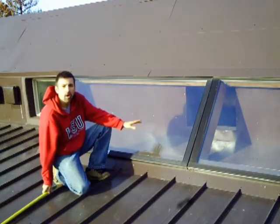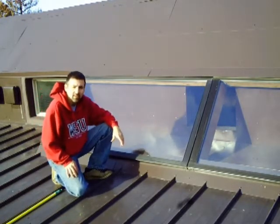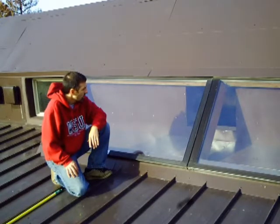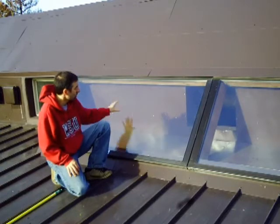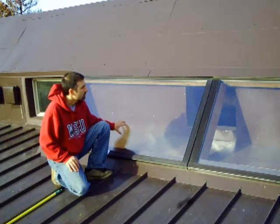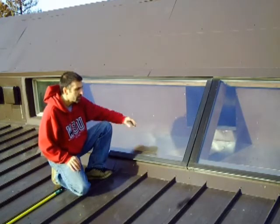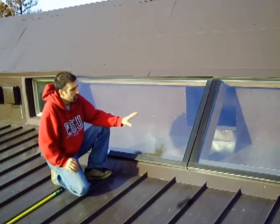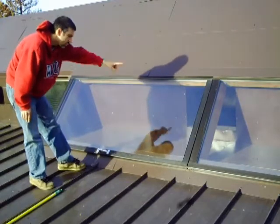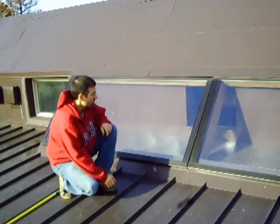Here you can see our batch solar hot water heater enclosure. With this house I built two of them, so we'll be heating two 40-gallon tanks of water in this enclosure on a daily basis. This enclosure is fully insulated with between two and four inches of rigid foam all around it, so it will certainly hold the heat well. Instead of buying glass and using the mullion system to lock glass into place, I bought just a couple of bronze aluminum patio sliders — a total of $100 for both units. I just pulled the doors out, put a handle on a couple of hinges and some weather stripping, and now I have a batch hot water enclosure with easy access for maintenance or changes.